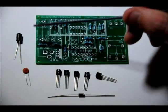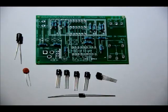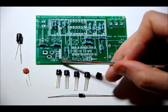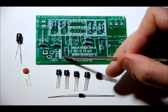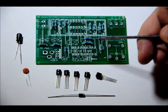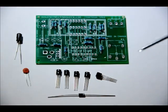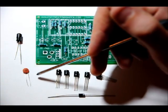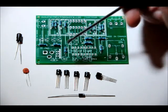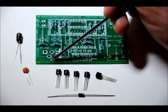The 100 microfarad electrolytic capacitor has a short lead and a long lead. The long lead is positive, the short lead is negative, and that goes in the C2 slot. The left pin has a little plus sign — place your long lead in the left hole and your short lead on the right. If you reverse it and power it on, you might blow up that capacitor. Your 0.1 microfarad ceramic decoupling capacitor goes in the C1 slot. It is not polarized, so just make sure it is placed properly and flushed into those leads.